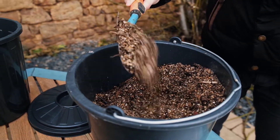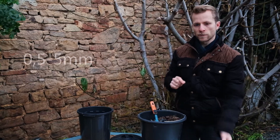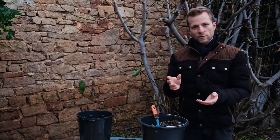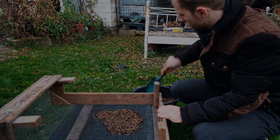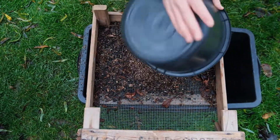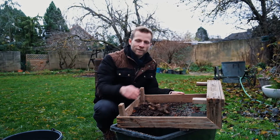The first bucket is filled with gravel. It helps to filter out coarse materials and suspended solids from the water. It is important that the gravel has a certain size — not too big and not too small. If it's too big, the water runs through it too quickly and not much will be filtered out. If it's too small, the system may get clogged and no water will get through.